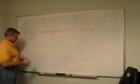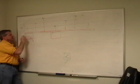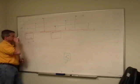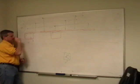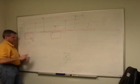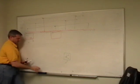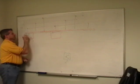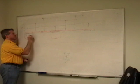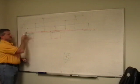But now what happens is, if my photon of light comes in and hits in here, this is a huge field. This is a diffusion area. It runs all the way out like this. So I create an electron hole pair, but now the hole immediately runs away, and the electron is immediately pulled up to there. So as light lands, I get some more electrons, and they all want to be right up here, like this.